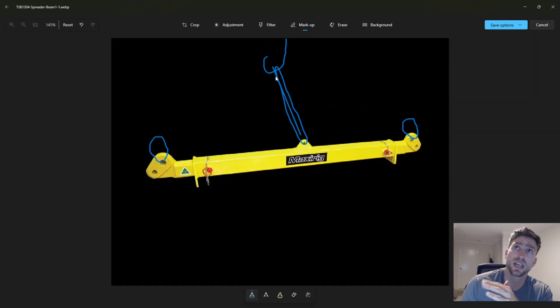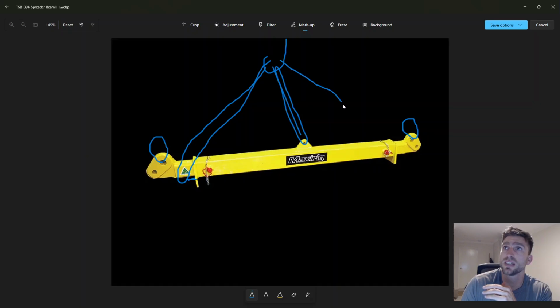If you don't have a shackle handy and you just got the two chains, what we want to do is basket the chain down this side, and then back up around this side on the outside of this frame so it can't slip in. And then you want to basket this side of the chain around underneath that end and back up. And that's going to hook into this bottom stand where the spreader bar stands, and it can't slide in that way.